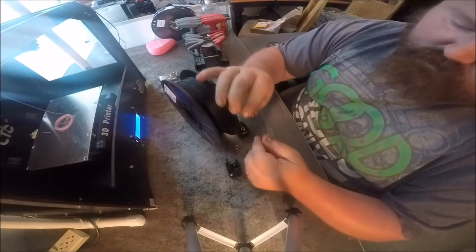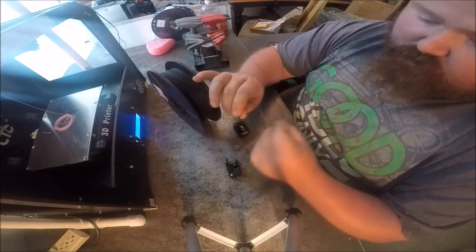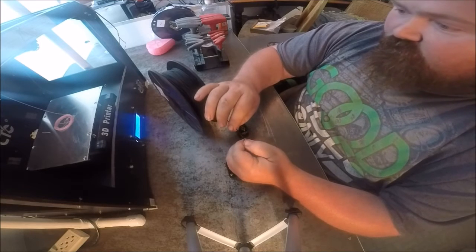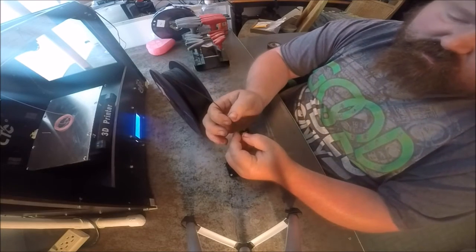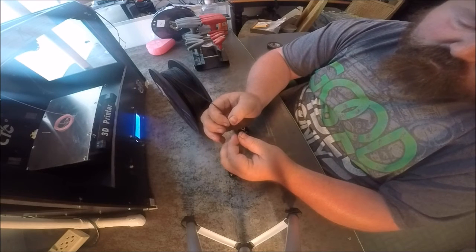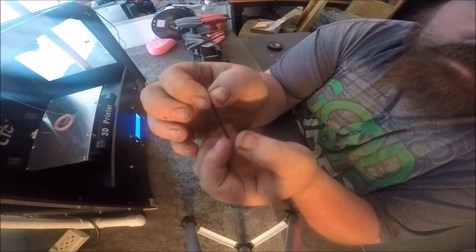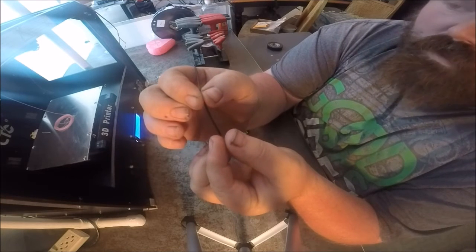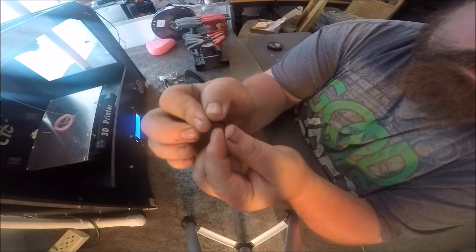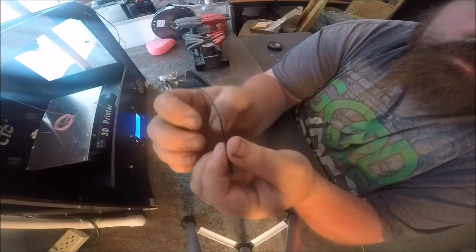I want to make some phone cases and stuff out of it. But when I put it through, I thought my 3D printer would print anything — no, it won't. The extruder grabs the filament from up here and tries pushing it through the nozzle, but when it goes to push it through, the flexible filament just buckles. Then it just sits there clicking, trying to stretch it a little, and does nothing — which kind of sucks.